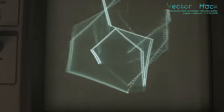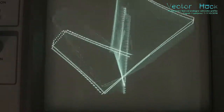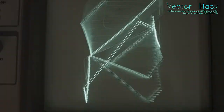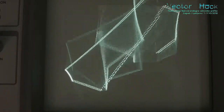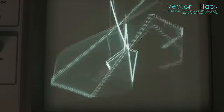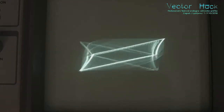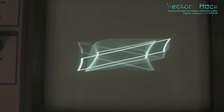So the frame rate is bad, but that's a more interesting shape. You can see, that's really pretty. That's a very typical oscilloscope artist shape. Can you explain what's happening right now with that? There's 2 triangle waves. So the hard edges that are there come from the two triangle waves. If you plugged these into speakers, you'd hear 2 tones. Two really similar tones, because stuff looks really nice when you have harmonics of the sync frequency.